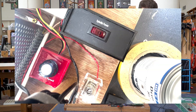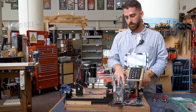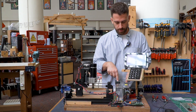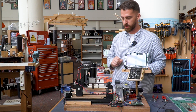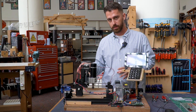I've got the controls back here, which I can all operate with my right hand — spindle speed, I can shut off the motors if necessary, and then I've got spindle power on a switch. Two power supplies here offer plenty of amperage for the needed movement of motors and spindles, and I've got the AC inputs coming here, which uses two power adapters to get DC power to everything where it belongs.